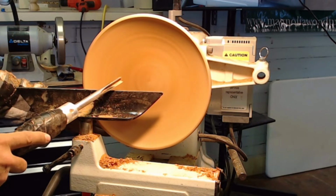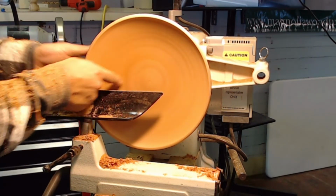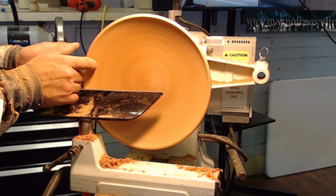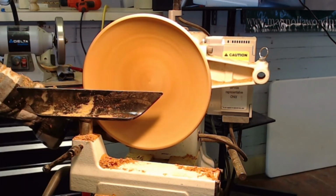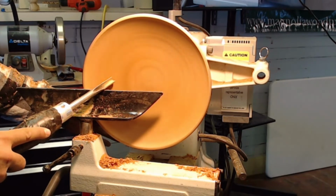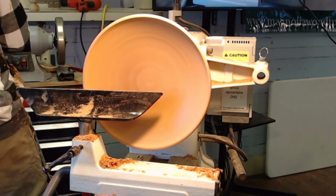So let's go ahead and slow the lathe down again. Back to the area where you're going to see a lot of the chatter. It's going to be right here. The mid portion of the piece is where the inertia has picked up, and on a thinner wall vessel, which is probably under 1/4 of an inch, okay, that's thin. So I need to make sure that I'm starting at about 400 to 600 RPM right here again. I'll start about where I was. I'll put one more little final edge on here, and we'll probably call this piece good in terms of turning.